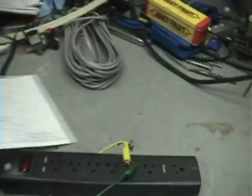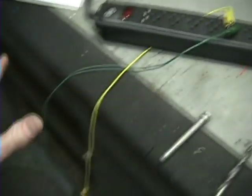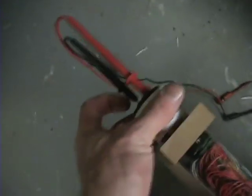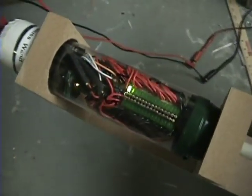I'll show you what I got real quick. I have a power switch here hooked up so I can just turn it on and off. AC 120 volts coming out to a bridge rectifier, then to the light bulb and off to my coil. I've got some nice terminal blocks on this coil which give me an easy way to wire this up. I've also got my meter here that I built — it's a gauss meter.